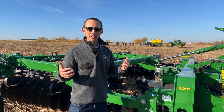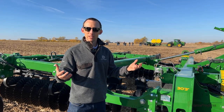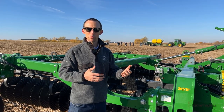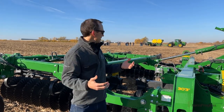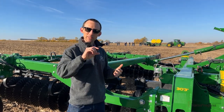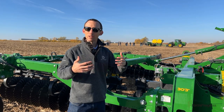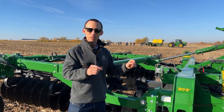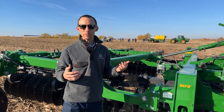What can impact that is if conditions are a little wet and you have some mud buildup on tires, or perhaps tire sink in a wetter area — such as even the wheels behind us here today, which have a little mud built up on them. As that mud builds up half an inch or an inch or so, it compromises the actual working depth of that tillage tool.